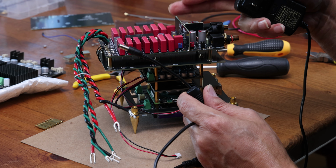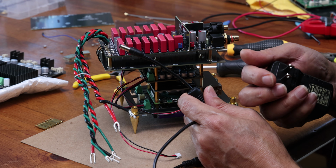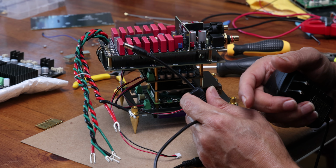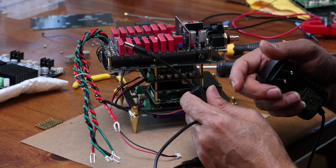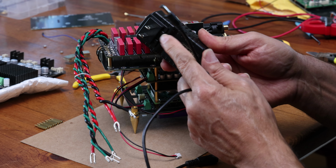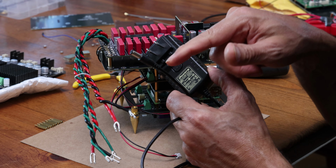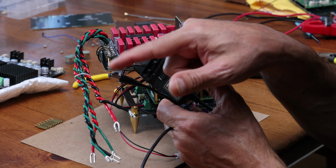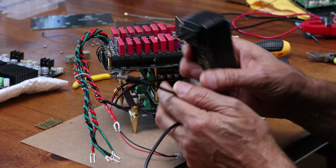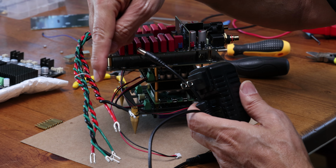And if you don't see it right away, as soon as you plug the RCA into an amplifier that has grounded RCA plugs, you will see that short. So please be careful. Do not use any power supply. If you have a power supply that has 3 prongs, test with a test meter that there is no connection between the negative and the ground of the power supply. And that's the same for the plus 5 and the minus 5.